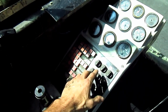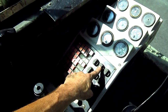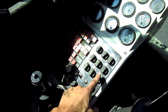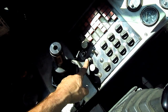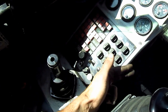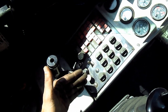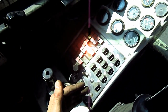Also on the control console, you can see switches for the main engine start and stop. Here you can see switches to control the front windshield wipers and headlights. And this switch down here is a rather unique one — it will disengage the clam foot pedals so that they can be used instead to tram the machine forward and to turn left and right for straight long travels.